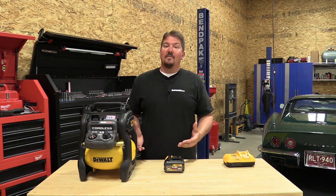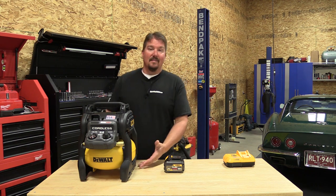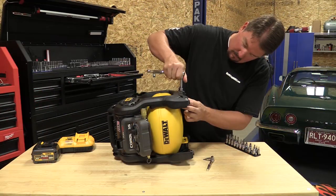This is not going to run an impact wrench, a lot of die grinders, or most pneumatic tools, because they're going to need more than 1.2 SCFM. But overall, this is a nice unit that's fairly quiet and has a lot of rubber on the bottom to stop vibration from transferring to whatever it's sitting on.